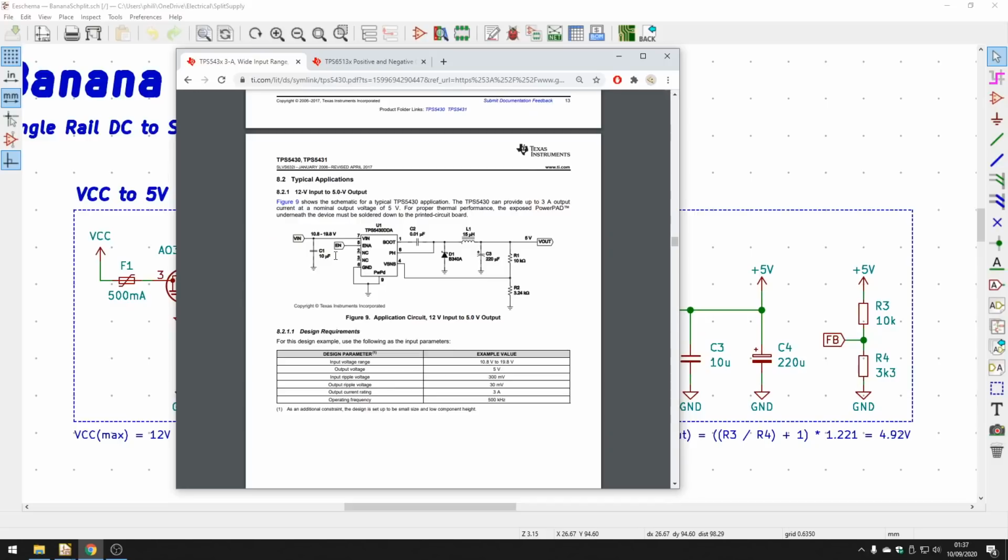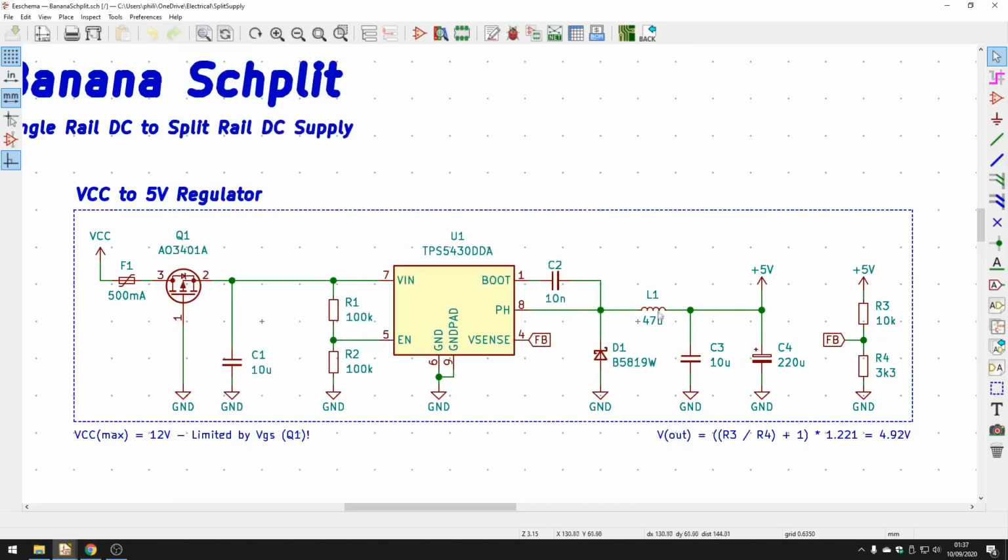What size capacitors do you need to choose? What diodes need to be where? And what inductors? So my tip is just follow the datasheet. And this will tell you also how to size inductors. It'll give you equations depending on what load currents you have, what input-output voltages you have. You can size the inductors, output, and input capacitors.